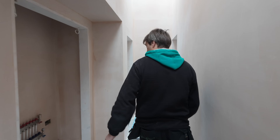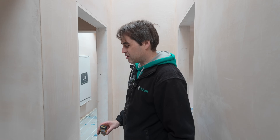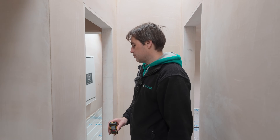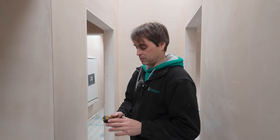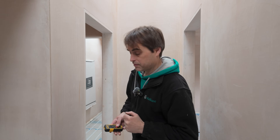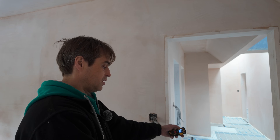The pipework is down — I wasn't here for it; Marie did that with Richard. The screeding guys are here and they are about to put latex over it. We are just a bit worried — they only have a ton of latex that should cover around 100 square meters max, maybe 90. We may be a bit short, so we're trying to decide if we have to block off one or two rooms and come back to do it by hand without the big mixing machine they have. We're going to measure it to see the actual square meterage, because when we ordered the panels from the plans we ended up with three boxes too many, so maybe this is smaller than on the plans. It's actually 93 meters, not 104 as I thought — we should be fine.